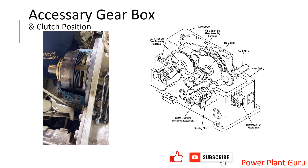Looking at the physical equipment, this is the gearbox we were talking about. The clutch assembly used at startup starts the gas turbine, and once startup is complete this clutch is disengaged from the starting device side. Now your gas turbine is connected through the gearbox shaft, and whatever speed the gas turbine is operating at, this shaft is operating at that speed.